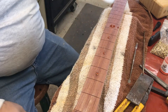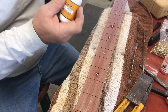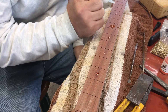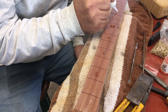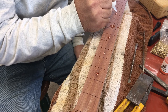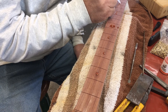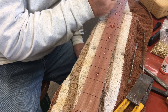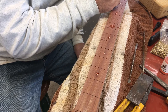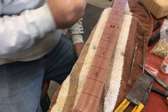I'm going back through now and adding another application of CA glue — this is a medium thickness. I've sanded down to 320 and I have it pretty much looking like I want it to look, but there are a few little voids where it's not flush to the surface. This thick glue will fill those voids with a clear coat. It will also protect that brass from oxidizing.